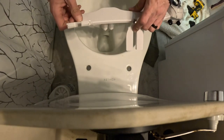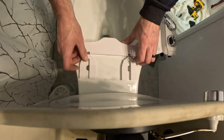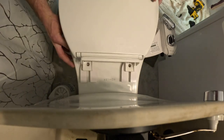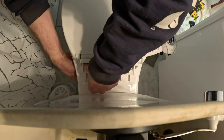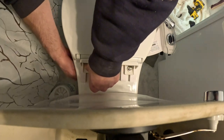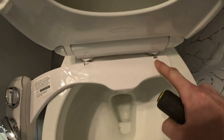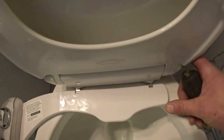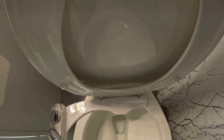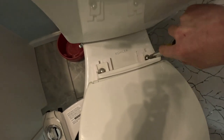After that you're going to clean under your toilet lid because it usually is disgusting, and then you're going to add the bidet on there. Get that placed back on there, and we're not going to worry about it being exact until we check out the front and make sure that gap is where we want it. They say about a quarter of an inch, but if you don't like where it's shooting, this is where you're going to come to make the adjustment. Once you've got it where you like it, go ahead and tighten those bolts up.